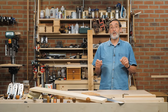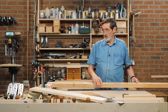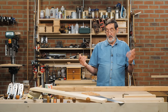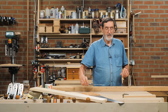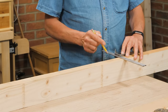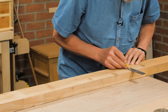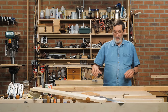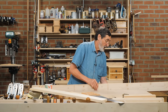I'm going to show you how I would do it for a couple of scenarios. One, if you've got a stud that you want to cross cut, or some joists or something like that — that's a different level of refinement where you don't need fine joinery. You're not trying to construct a perfect joint, but you want something that looks fairly neat and nicely done. In that case I would simply pull one square line on this face and another square line on this face.